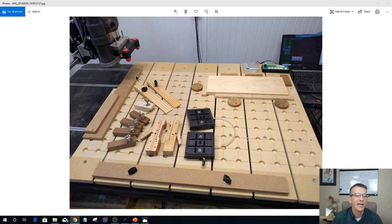And because my cams and everything are low profile, meaning if I'm carving in a 3/4 inch board they sit below the surface, I really don't need double-sided tape or anything like that. I've got an open surface to mill and surface and carve. But if there was ever a need, like if I'm doing smaller parts and I don't want to put tabs in it, and I need double-sided tape, I can do that. I can hot glue it, generally double-sided tape.